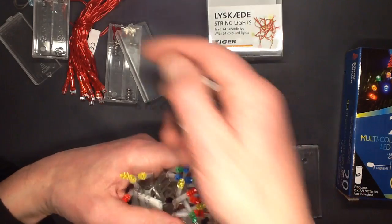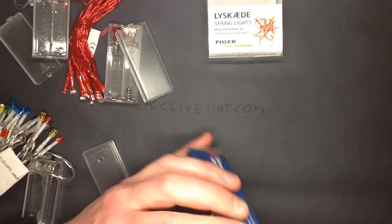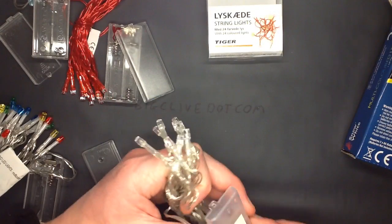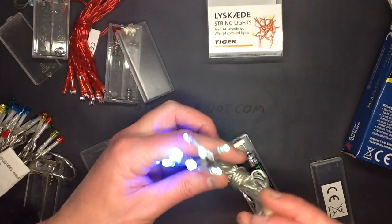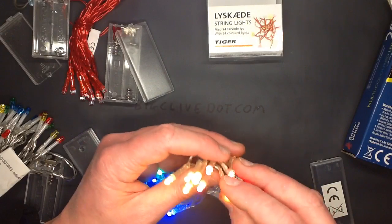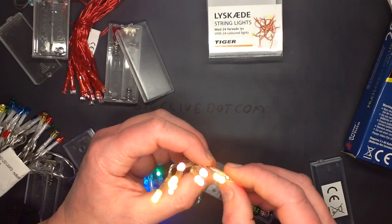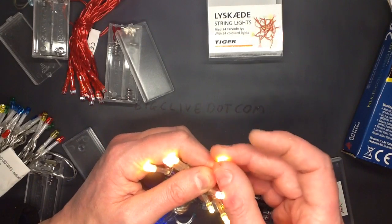At the moment, apart from Tiger's novelty aspect of the color choice, the other ones are all holding up fairly well together. It would be interesting to do a long-term test and see when the battery voltage went down what sort of intensity would be kept if the LEDs were all pretty well matched. All it takes is one rogue LED having a slightly lower forward voltage and you end up with it being the only light on the set. This last set is unusual - the greens may actually be green chips. The blues and the red and yellow are both phosphor. The yellow is quite a whitey yellow, quite attractive, and the red is a fairly soft, pastely red. These are also slightly domed - the others just seem tapered at the tip.